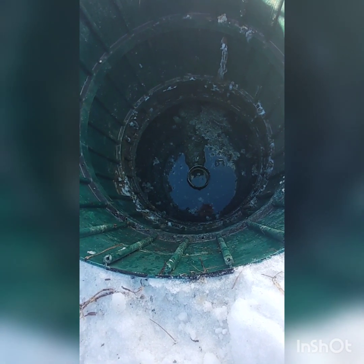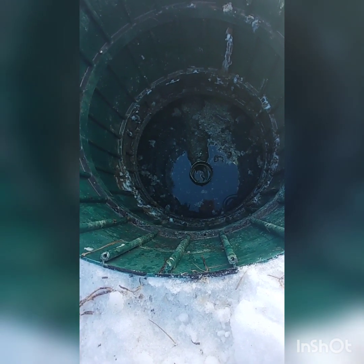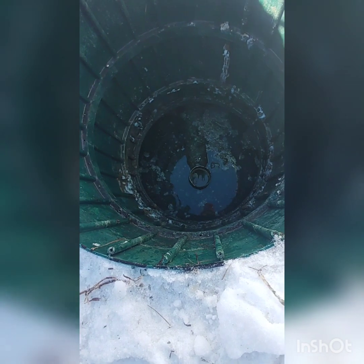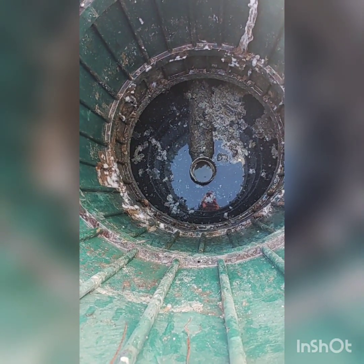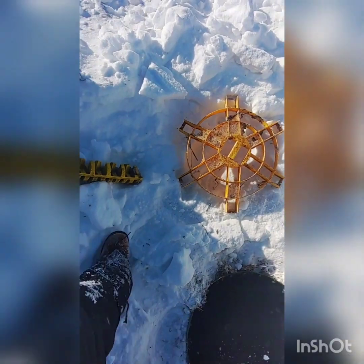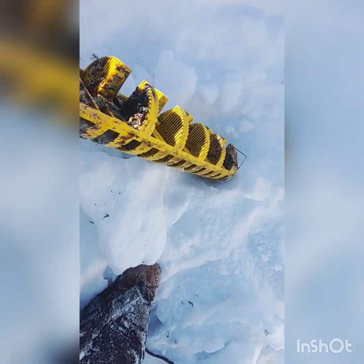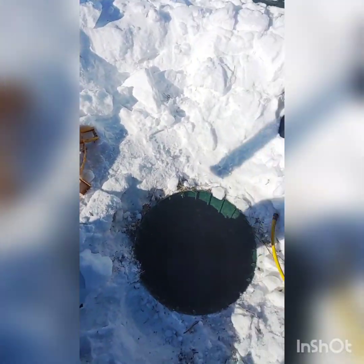We were able to find the tanks, pumped it down just a little bit so we could get the filter out. Once we pulled the filter out — which was pretty gelled up and clogged up — the drain lines are flowing now. The tanks are about a hundred feet from the clean-out outside. You can see the effluent flowing out into the leach field, so that tells me the leach field is not collapsed. This was a heavily plugged, gelatinized filter on the top and sides with debris that needs to be cleaned off.